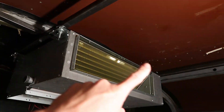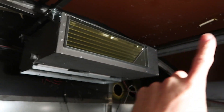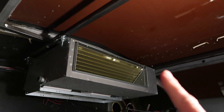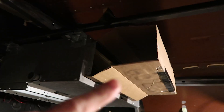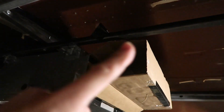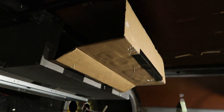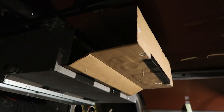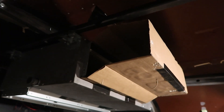The first thing with building the plenum — we can make it out of cardboard. We're going to angle it up and outward on both sides so that we can fit four four-inch tubes along the front, one on each side, and then two underneath that are going to come out for the bedroom. So three inches meets the top of the bar, then it goes straight across for six inches, the front is five and a half inches, and the bottom lines up perfectly with the ceiling. We'll have two four-inch openings for the bedroom. I just have to map out the sides and cut it out of the sheet metal.